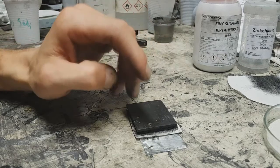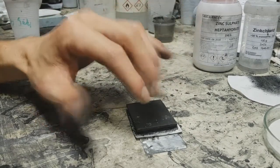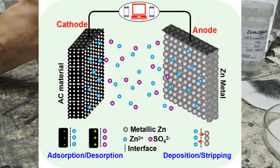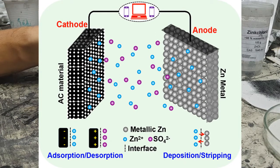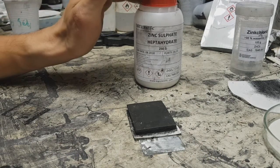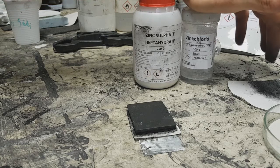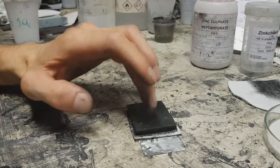Like I said, it's all about experimenting and you need to experiment with this. I also read some research papers on similar devices. In one paper, the electrolyte used was only zinc sulfate, and the researchers claimed the capacitor had over 10,000 cycles. I tried with zinc sulfate alone and got not really good performance, but adding zinc chloride gave really really good results — 8 minutes of charging and 40 minutes of discharging.